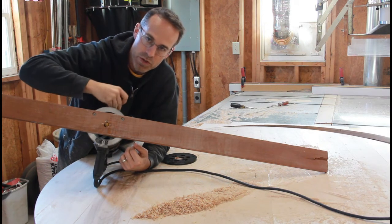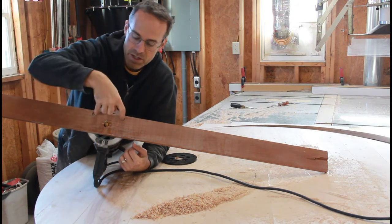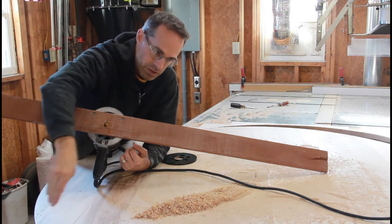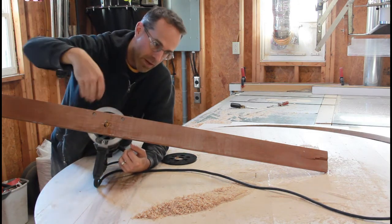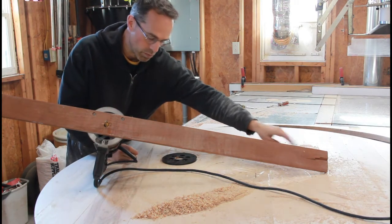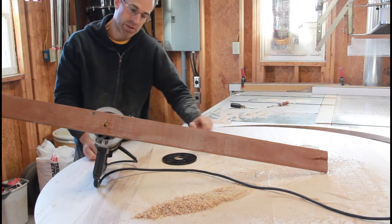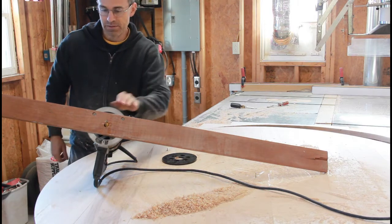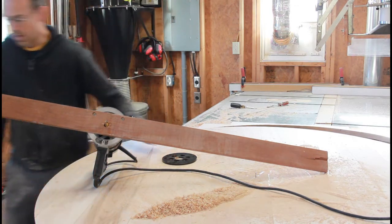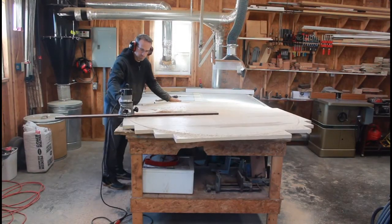I didn't want to try to bite off too much and have a jagged finish. The board is attached to the base of the router, I plunged the bit through, and then you just continually step down, plunging further into the wood as you go around. It's just a nail in the middle of the table that went through this board as well. This isn't my idea — lots of people have been doing this many ways — but perhaps this gives you the confidence to try it, because if I can do it, you can do it. Here you can see the process underway: I plunged into the tabletop and worked my way around.